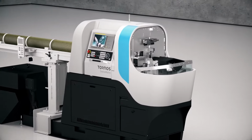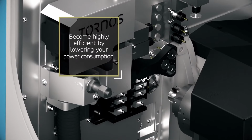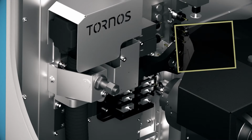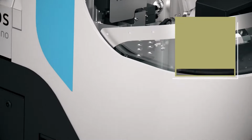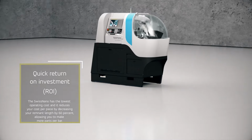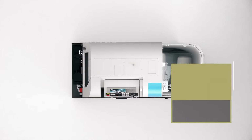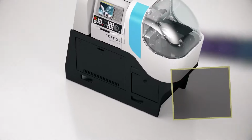Well, in the electronic industry, we have a lot of high precision connector. Many people around in this trade fair are wearing a smartwatch, for example. Those small circuit board, the test pin to test them to make sure they are reliable are also small. The little sister of this one has manufactured from a bar of 1 millimeter, and it was a test pin designed for a small circuit board, and it was the smallest part we ever produced on a Swiss type lathe at Tornos.